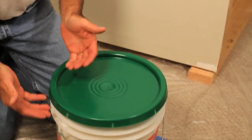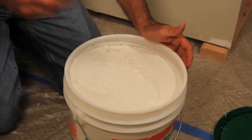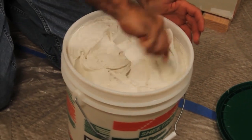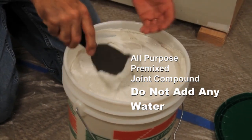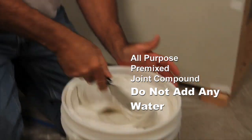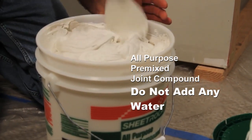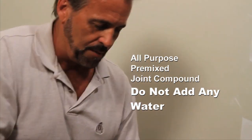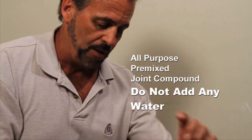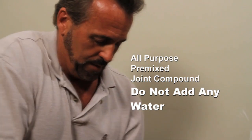This is a typical bucket of drywall joint compound. When you first open it up, take a drywall knife and just mix the top of the mud. What happens is, when you open a container sometimes there's a little bit of water sitting on top. So just take the drywall knife and work it around. If it's real wet on top, get another bucket, take a little bit of the mud off and put it in that bucket — you can work that in later. That will get you to a little bit of the drier mud. Scrape that off.